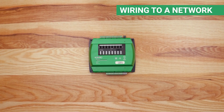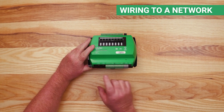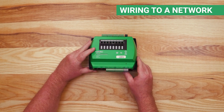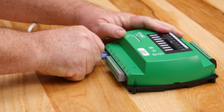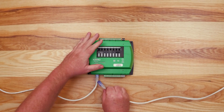This BAC-5901 controller connects to the network via BACnet over IP. This model includes two Ethernet ports with a built-in switch, allowing for easy daisy chaining on the network. From the previous controller network, plug the Ethernet cable into one of the ports. Then, to daisy chain to the next controller, plug the other cable into the second port.